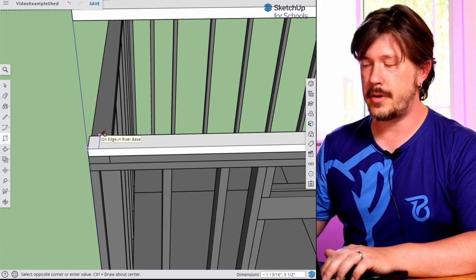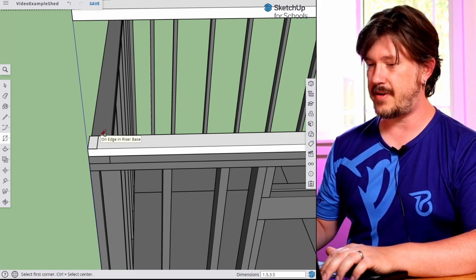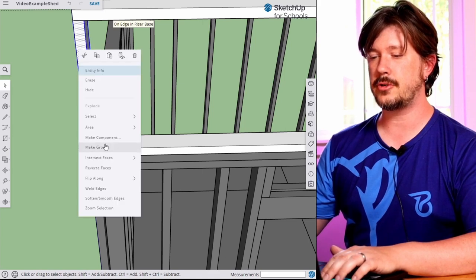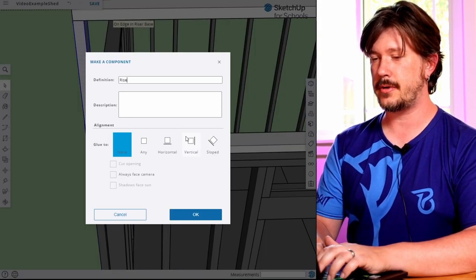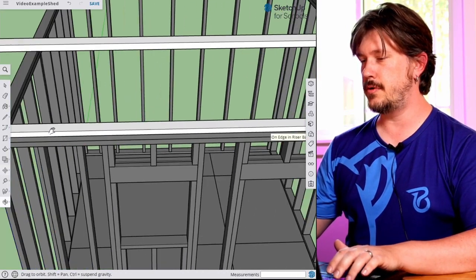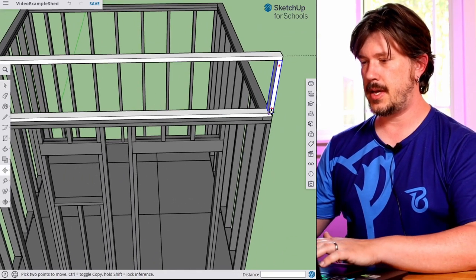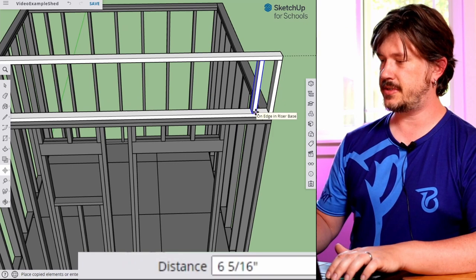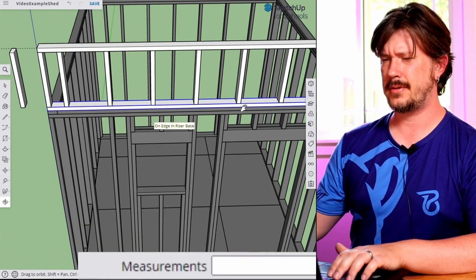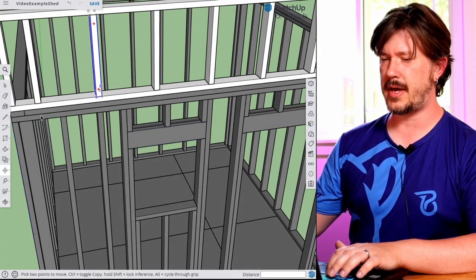All right, so we're going to build our riser wall. This is going to be 1.5 by 3.5 for the stud on the end. We'll go ahead and raise that up, triple click, and make this riser stud. And then we're going to move copy this all the way over here. And like before, we're going to fill out our 16-inch spacing. So 16 inches times, what is it, 8? That was too many, times 7. There we go. We'll call that good.